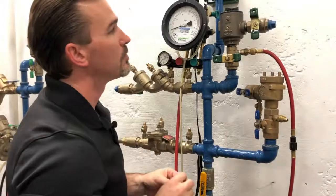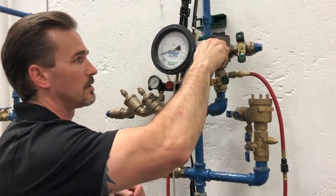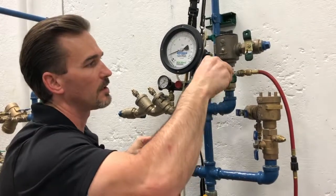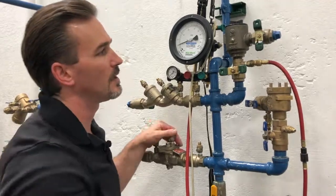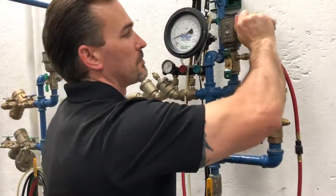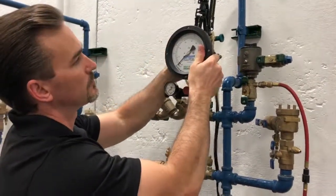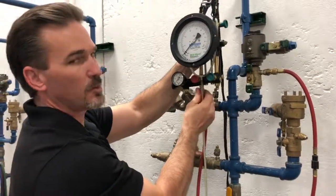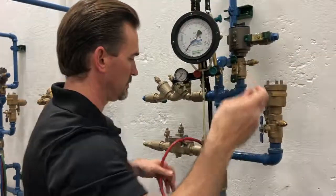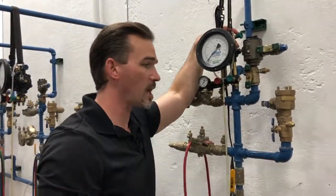For test completion, we're going to reinstall our vent valve screw. We'll close our test port. We will open shutoff valve number one, then slowly open shutoff valve number two to pressurize our system. We'll open all of our gauge valves and remove our hose. That's the end of the test. I hope this helps you out. If you have any questions or comments, leave them down below. Thanks for watching.